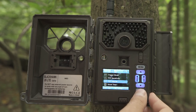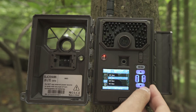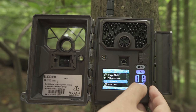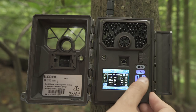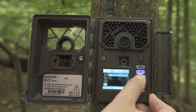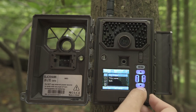To adjust your PIR interval, hit the down arrow then hit OK. The camera will be triggered based on the interval you select; we recommend using a 30-second trigger interval. Hit OK to save, then hit Menu to go back. If you want to control when your camera operates, go down to Work Time 1, hit Select, and hit On. From here you can select the time your camera will operate. Hit OK to save. If you want your camera to work all the time, make sure your work times are turned off. You can create up to four work times on this camera.